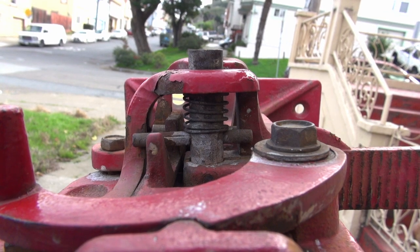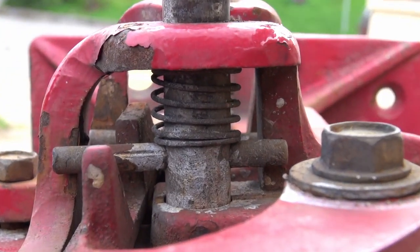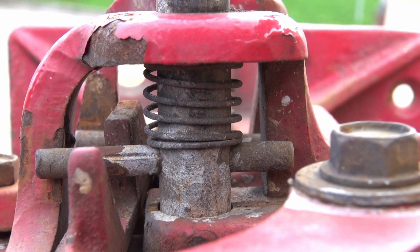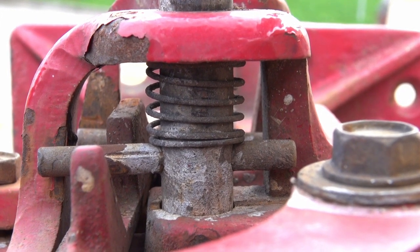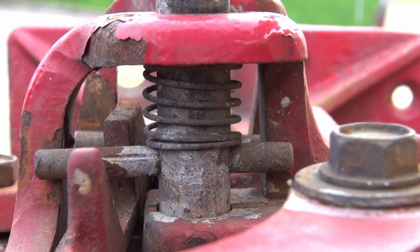Let's take a closer look at the climbing pin. You can see some of the corrosion on the spring and the cross pin, as well as all of the old lubrication on the climbing pin. What we're going to do is drive this cross pin out to the left of the screen and we'll replace it with the parts that are in the repair kit.